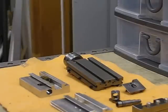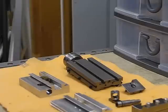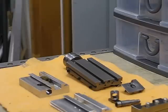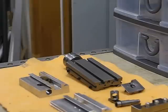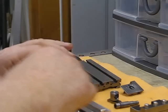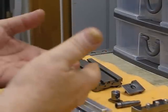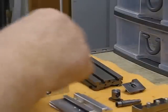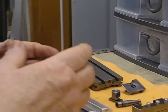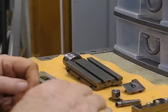For the last 20 years of my working life I worked daily on HLV Hardinge toolroom lathes, and they have some beautiful features. One of the features is the location of the top slide on the cross slide. All it is is a floating pin that's loose in the cross slide — it goes in from underneath. It has a head on it but it floats, so it doesn't have any effect on the accuracy of the top slide or where you position it.